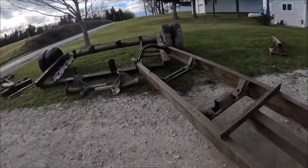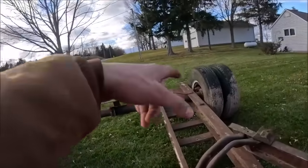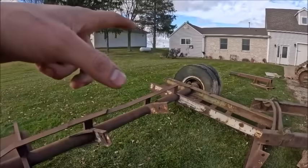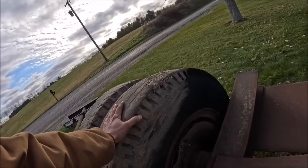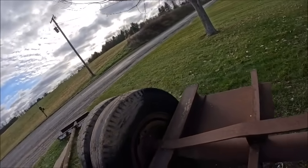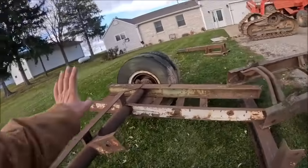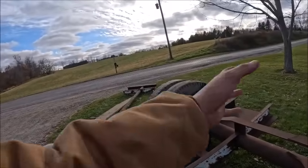This is the combine mover — she's seen some better days but it'll get me going. I already got tires lined up for this thing. For some reason when they built this they took all the brakes and hardware out of that wheel but didn't take it out of this wheel, so the brakes are hung up. We've got to get that backing plate cut off and knock all the brakes out, then that wheel should free up.